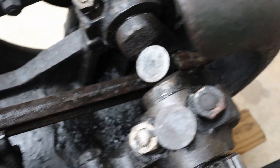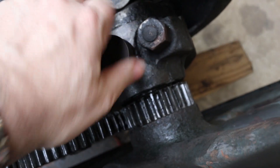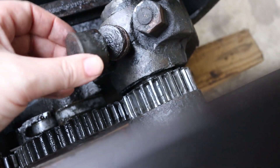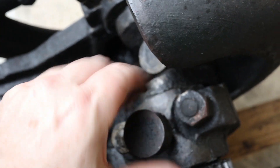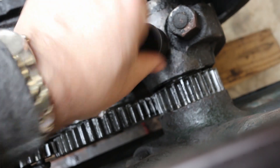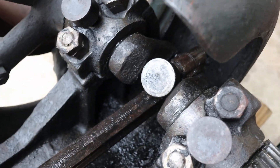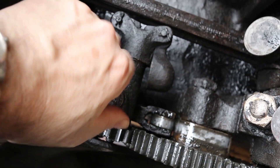We've got the oil, the grease cups. These little cups here are full of grease. What you do is as it runs, every so often you give it a quarter-turn tightening, and it squeezes more grease through a little hole to lubricate the bearings. These two are the main crank bearings on either side, and then your connecting rod has one as well, right down here. And then there's a little one for the governor.